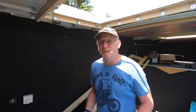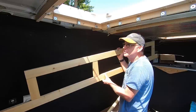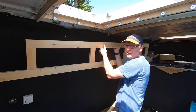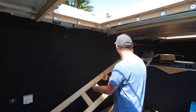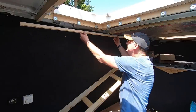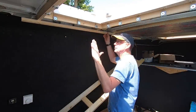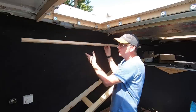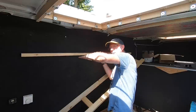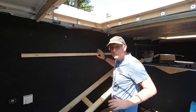I'm going to construct these overhead lockers the same as I did in my van. I've simply got a front frame - this is the main structure of the cupboard, that's what it's going to look like when it's up there. To hold this in place we simply use two pieces of battening: one piece is going to be fixed to the ceiling first, and then the front frame can be screwed to that. Then we want another piece at the bottom so that the bottom part screws up onto that, fixing it to the side of the van.